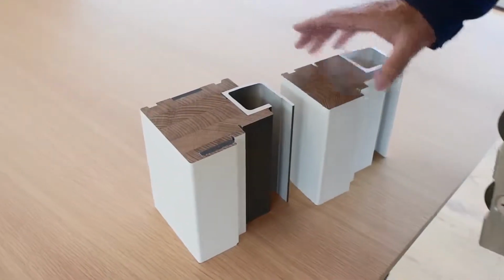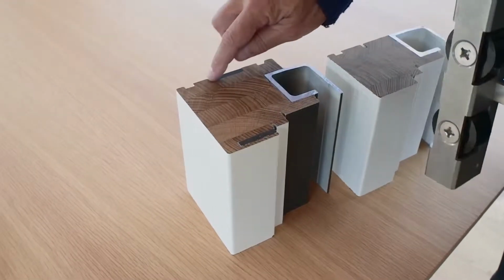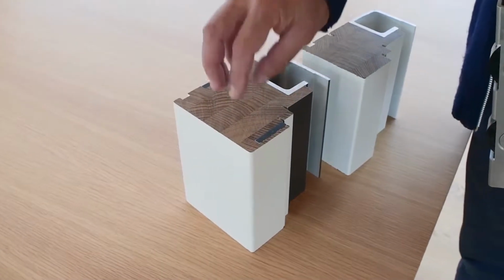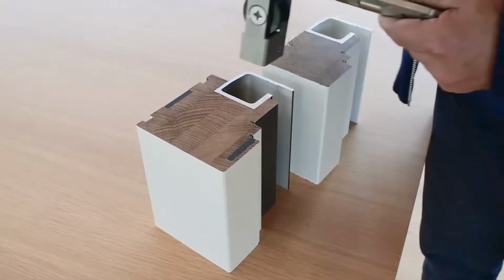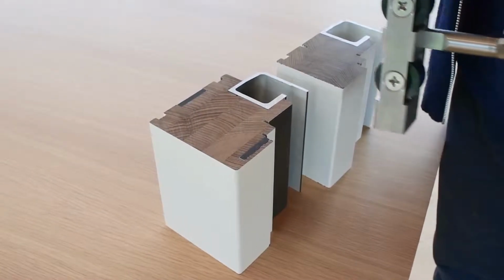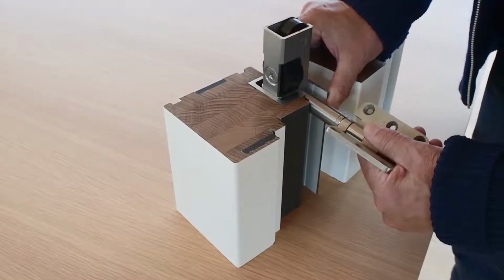This top frame is a bit taller, about 2 centimeters, and it is reinforced with carbon fiber. This allows for folding doors with a width of around 3 meters to be self-supporting. The top frame needs to be screwed into a house element to resist blowing winds. This top frame does however bear the panels and remains straight level.